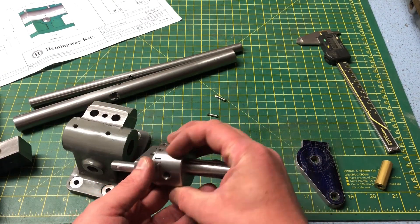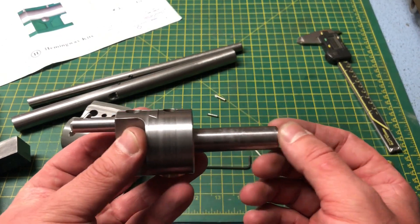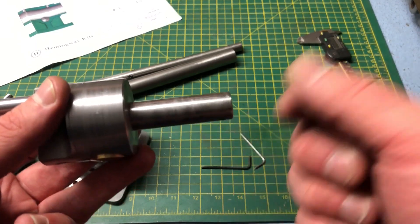That will sweep the cutter around in the correct direction. I'm okay to run the lathe in reverse, as this is a one-piece boring head that I've made myself, and it will be held in a collet, so there are no threads to unwind.